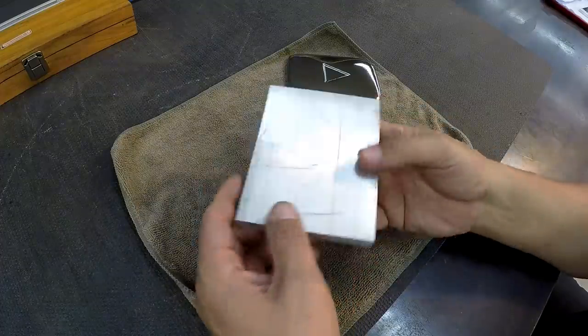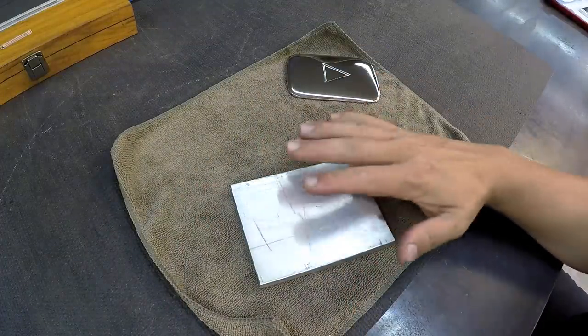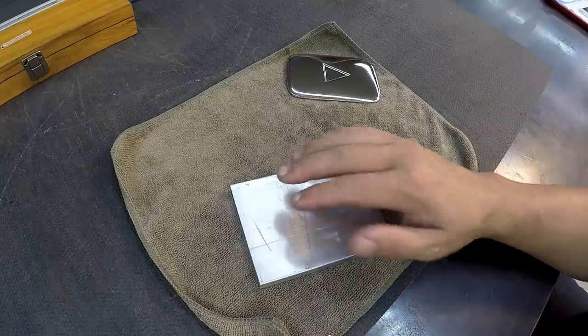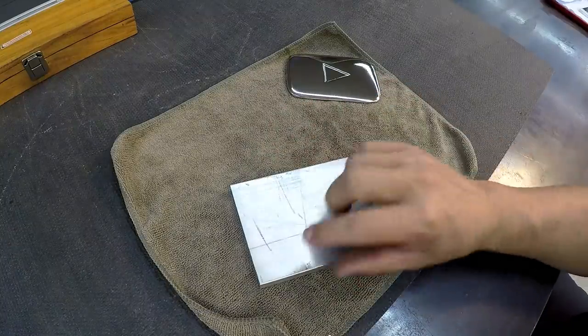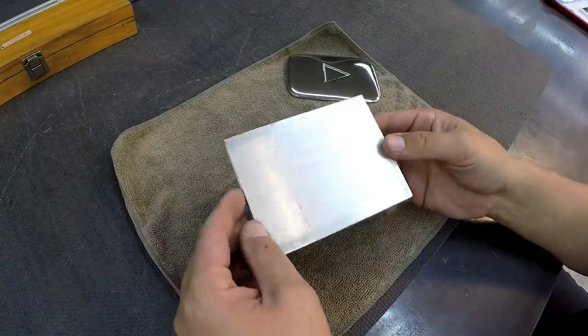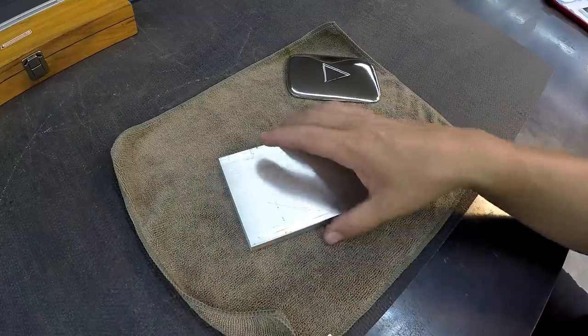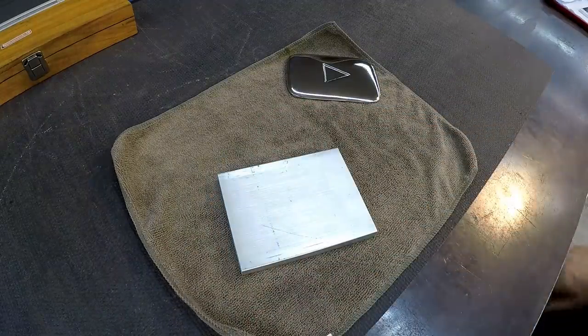And they're wanting to put four 1/4-20 tapped holes on the back of this. They're going to mount it. They're probably going to put some kind of all thread or something on the back of that and probably have it stand off of the grill just a little ways, I would imagine. So that's what they requested on the back. As far as the rest of it goes, they said, just use your own judgment on that.